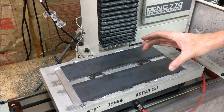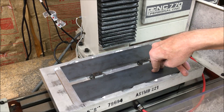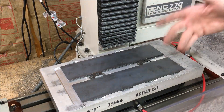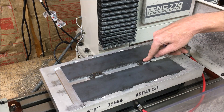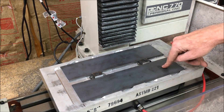Originally I had a fixture plate and I drilled holes and I actually bolted the part down. But in order to do them faster and not have to attend the machine as often, I decided to go with these expansion type clamps — these Uniforce clamps. But in doing so, it seems like the rigidity might not be as high.